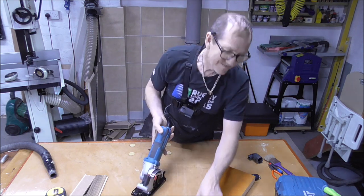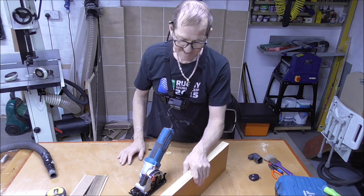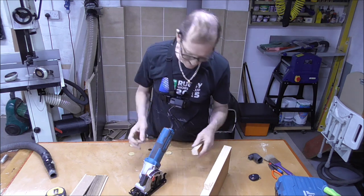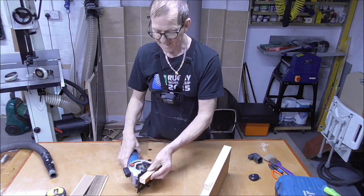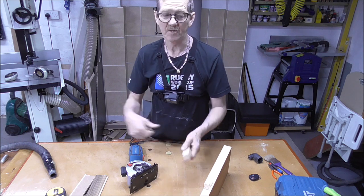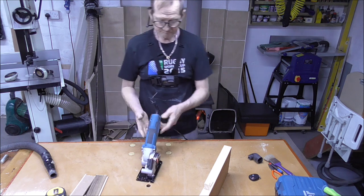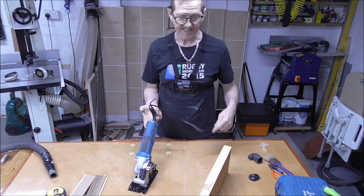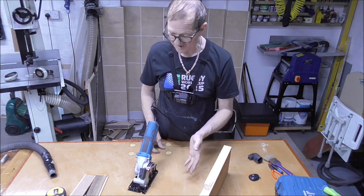And I didn't. And it's not like I'm new to using power saws. I didn't get one there, didn't get it there. It seems like when you're getting near the end, you lose the vision of the line. That last bit, you've lost it. And because you've lost it, you can't see where you're going and it's easy to wander off. So maybe using the pens, that'll prevent that. Or extending your line well beyond where you want to finish. That'll prevent that as well.